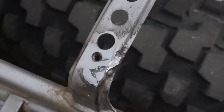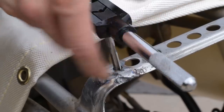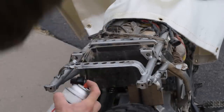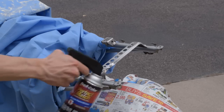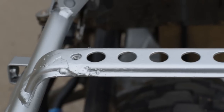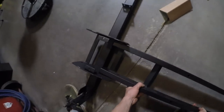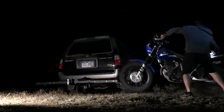Now I'll use a grinding wheel on my angle grinder to carefully grind down the top welds just enough so the rack will be able to sit flat — I didn't want to remove any of the actual cross member. I ran a tap through the nut to clean up the threads, then cleaned up the frame and used some painting prep spray. I masked the area off and sprayed about 3 coats of Perfect Match Galaxy Silver Metallic. It turned out a bit shinier than the original color, but it looks pretty good. Then I reassembled the bike in reverse order and with no time to spare I loaded up the T-dubs and headed out to Taylor Park to put my new weld repair to the test.